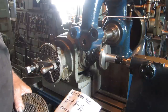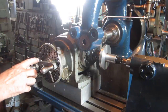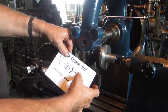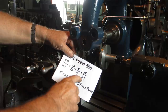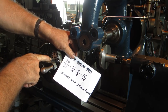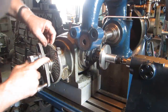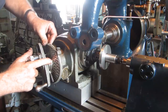So it just so happens that there is a row here on this one that is 24. So we're in there. The top number is the number of holes. So in order to make 64 teeth, we're going to advance each tooth 15 holes on a 24 hole circle. That's the bottom most inward row. It is right here, 24 holes.